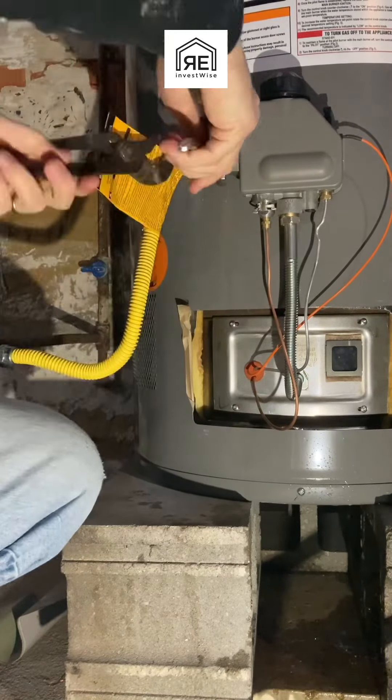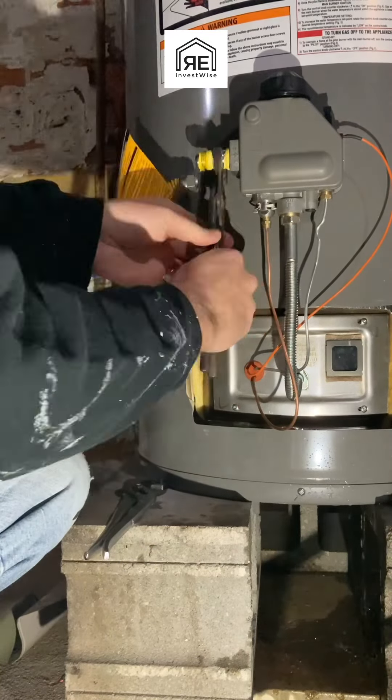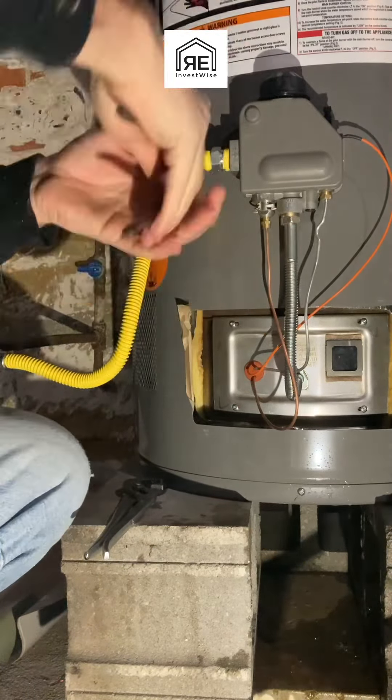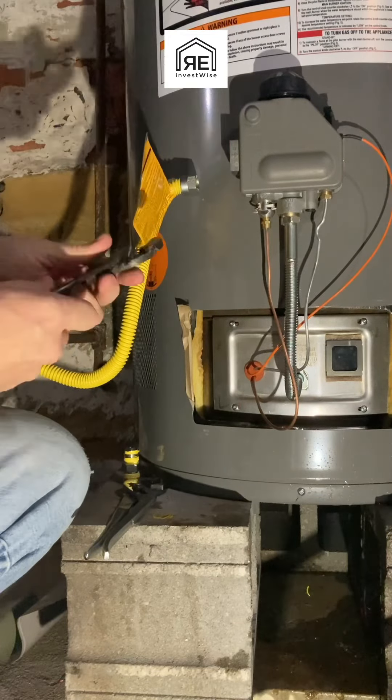You've seen I shut the water off, then I shut the gas off, then I hooked up the hose and started getting it draining. The hose was dripping — it needed a rubber washer, which I ended up getting and putting in there to stop the dripping so I could drain it.